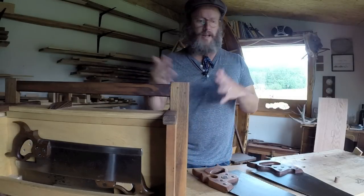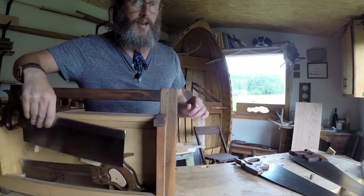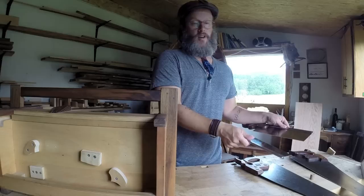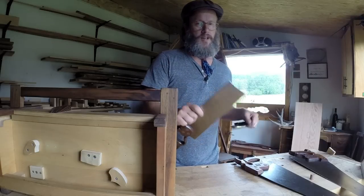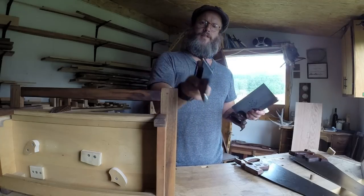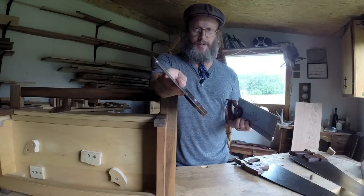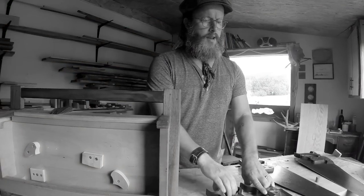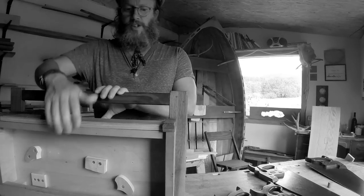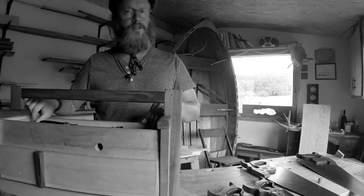That's my rough work — when I bring it in and have to rough down a plank to manageable parts. Let me stick to saws for a second. The only two I have here with me are another crosscut and another rip saw. You could call those the two large saws and the two small saws. This is a 12-point crosscut and this is a 14-point rip — you may call this a dovetail saw, or a small tenon saw. They're both 12 inches and fit on the back of the tool chest. This is the cabinetmaker's tool chest from my Made by Hand book.